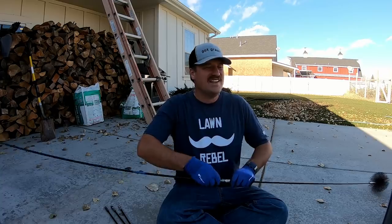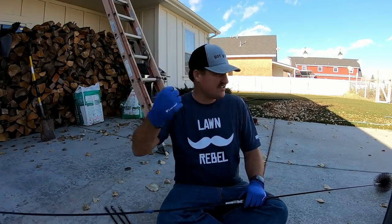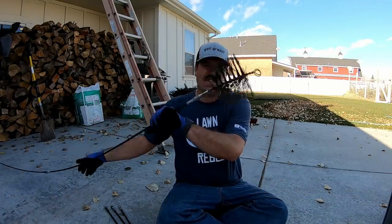All you do is get up on the roof and pull the chimney cap off. You just sweep the chimney up and down with this. They make different sizes of pipe — this is a six inch brush for a six inch pipe, that's the kind I have. There's also an eight inch brush and a four inch for a pellet stove. If you have a pellet stove, you likely have a four inch.